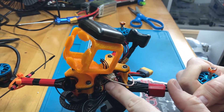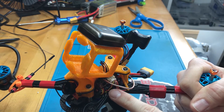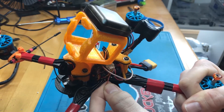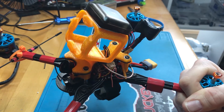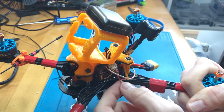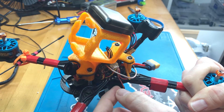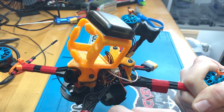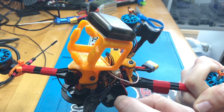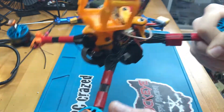The Unify Pro is wired through the OSD. I would have loved to wire up the smart audio wire, but unfortunately I ran out of UARTs on this build so I didn't have a place for it. There might be a way to do that with soft serial or some kind of resource remapping, but for now I'll just manually set my channel. Since this is an FPV rig and I'll mostly be flying by myself, that's not a big deal.